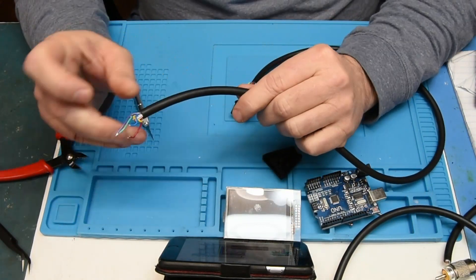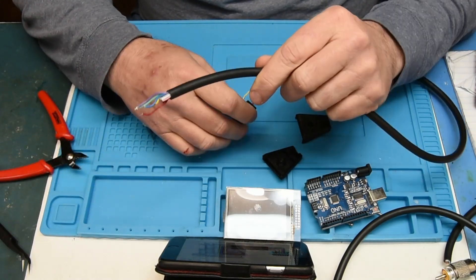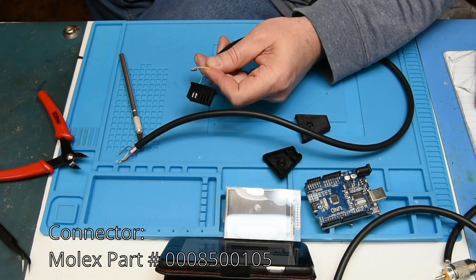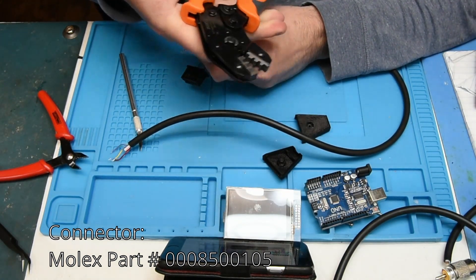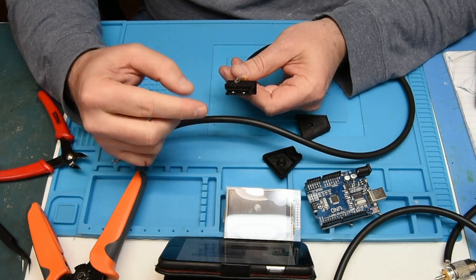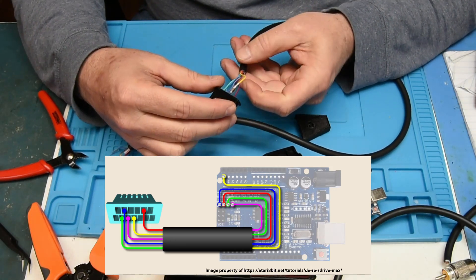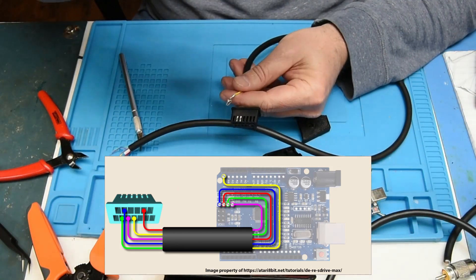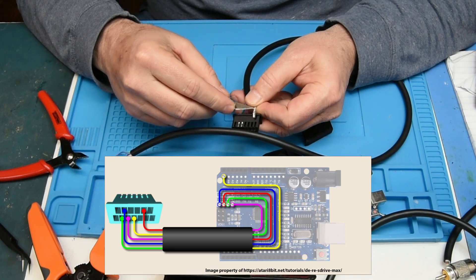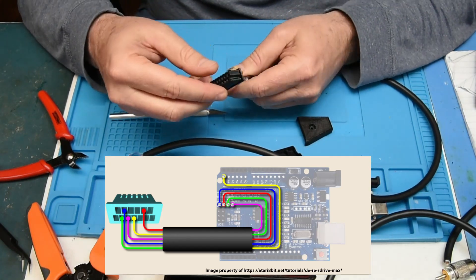I picked up some wire that had about 13 wires bundled inside. What I've done is gone through and crimped these connectors using a crimping tool, and then they need to be inserted into the SIO connector. The website has a diagram — I'll put it up as you're watching — and it shows the placement of each of these. You only need five wires, and there's a little tab here that needs to be pointed up so that when you insert it into the connector it stays.